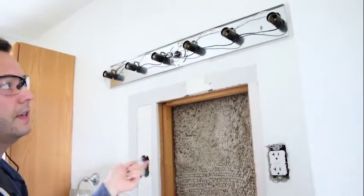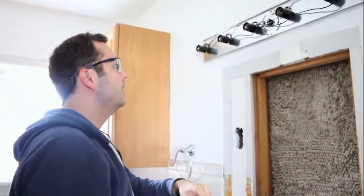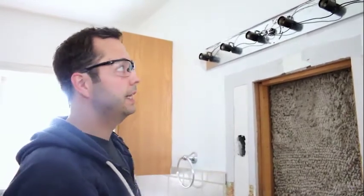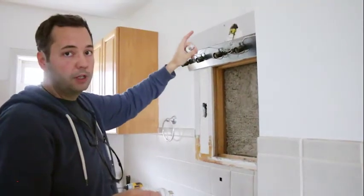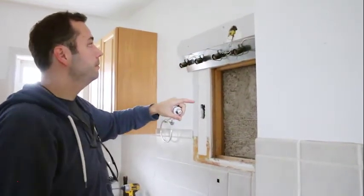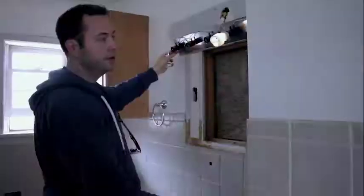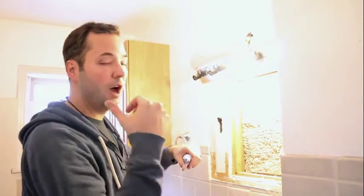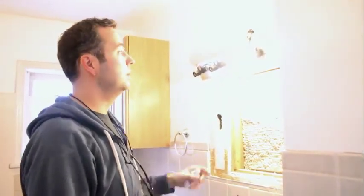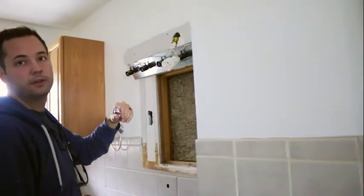If you're replacing a light that has the same footprint as the light in place, you may want to leave the light in place while you work on the rest of the bathroom. Because we need to do some sheetrock work and it's a different light going in, we're taking it out now and we'll use flashlights as needed. Before unhooking wires, make sure you're not dealing with live wires. If you don't have a circuit tester, put a bulb back in, turn the light on so you know it's live, then have somebody flip the breaker off. As soon as the light goes off, you know the power is off and it's safe to unhook and cap the wires until you're ready.